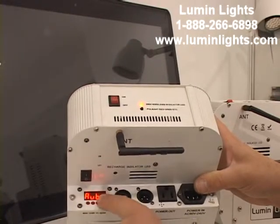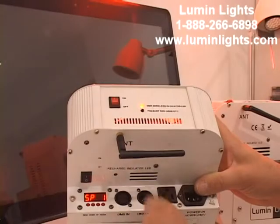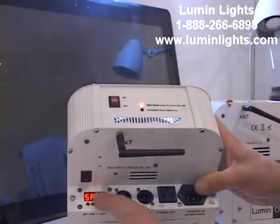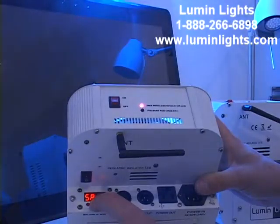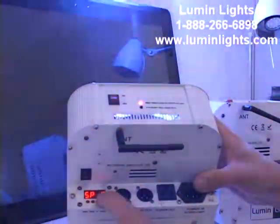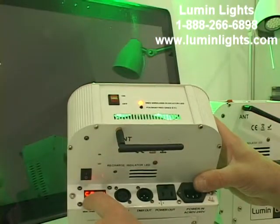Back in SHND, pressing forward again we've got auto. Auto mode makes the light jump from one color to the next with no fading in between. When you hit enter you see SP1 — this is asking for speed. 1 is the slowest, 8 is the fastest. You can see the light is flickering rather quickly at higher speeds. Set it back to 1, enter enter, then hit menu to back out.